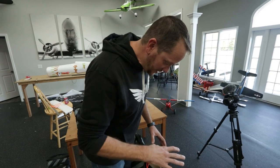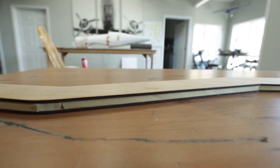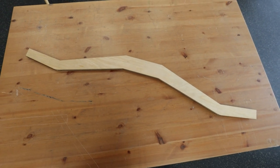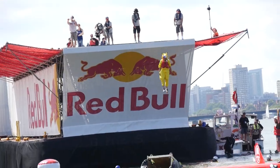What we have here is Noah built a box spar. A box spar is two poplar pieces sandwiched by plywood or even balsa wood. This is real common with balsa wood airplanes and also real common in general aviation, and it's incredibly strong. We used this exact same design when we did the Red Bull Flugtag, and the wing was so strong Chad was able to walk out on top of the wing right when it landed.